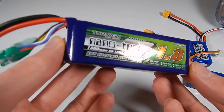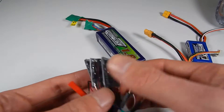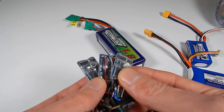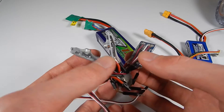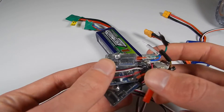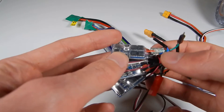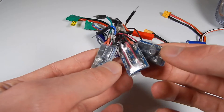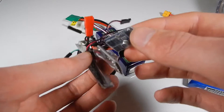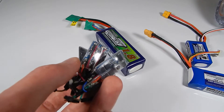4S is going to be double its rated voltage. If this doesn't make it catch on fire then these things are going to be pretty safe to run on 3S. That's why we are doing this experiment - to see just what happens when we overvolt these things. I think on 3S these are going to get a little hot but might be okay to run for a 3 minute bout. That's why we are doing this testing, to see if these things actually can or cannot run at that level of voltage.